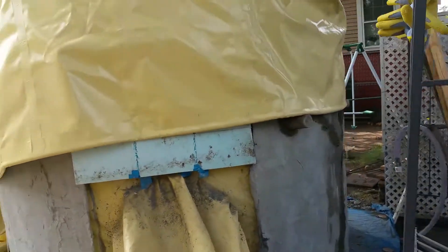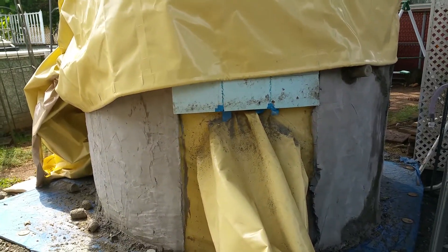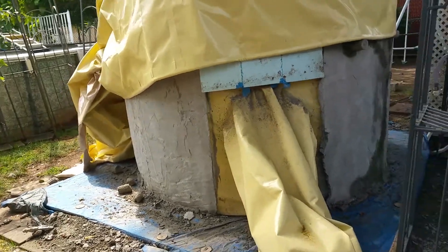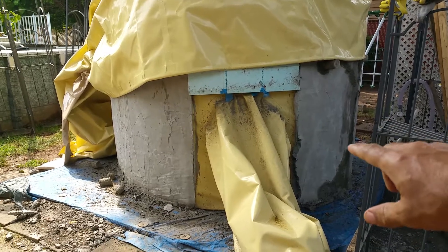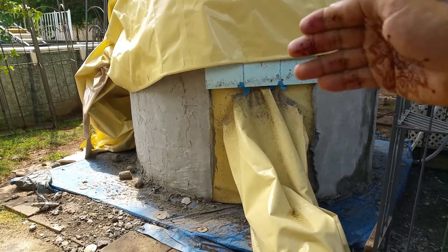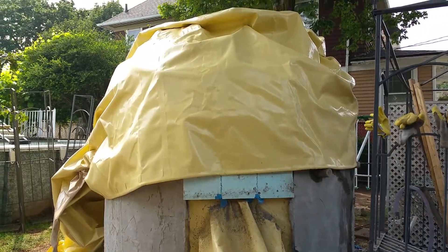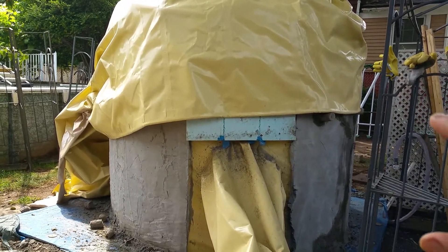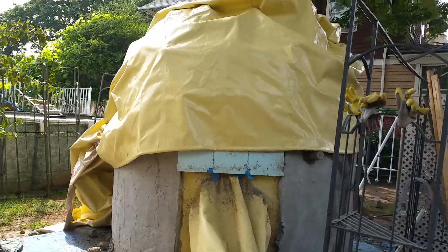The other idea I have — which is why I may need everyone's help who's watching — is to build a second dome very soon using the second method: inflate the first air form, bolt the second one down, and just fill in the cavity with aircrete. The entire structure should be able to be done in one pour in one day, because it's eight feet high and the foam bubbles in the aircrete begin collapsing around that height, depending on the foam solution you're using.